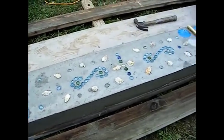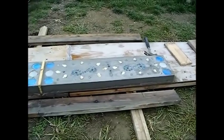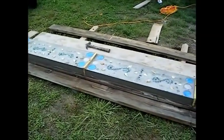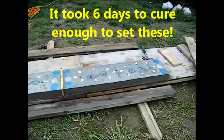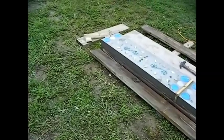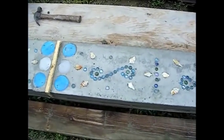Okay, at this stage because it's really humid out and because it rained, we didn't get this covered up with plastic this morning when the rains came. We got enough rain that it's still really soft, so we're just going to let this sit and rest so we don't knock off any more corners. We kind of lost a little corner here trying to knock out the boards. We're going to let this sit for another 24 hours — we're not going to touch it. If you pick one of these up now you'll break it in half or crumble it. The forms came right off with a little bit of oil — a little bit of that spray PAM, not an issue there at all.